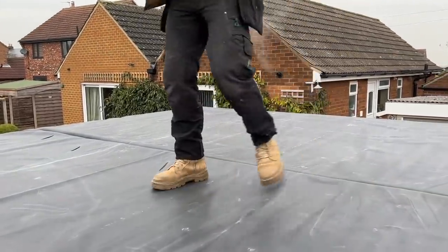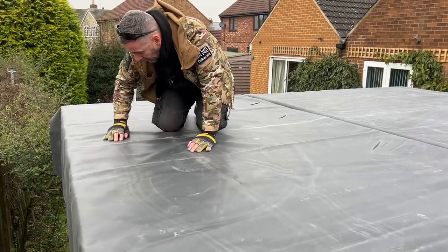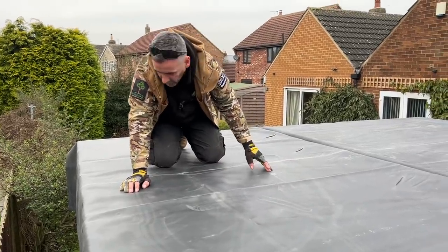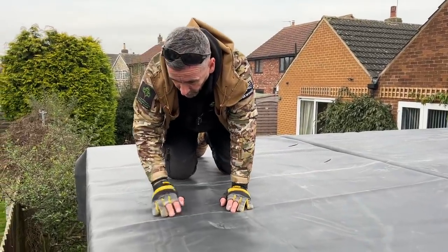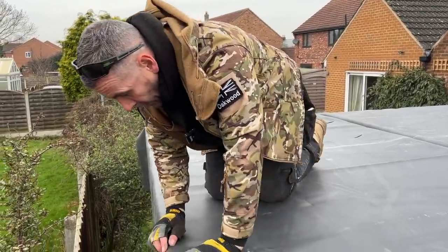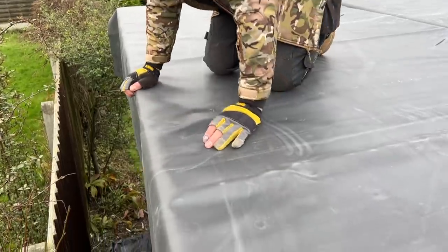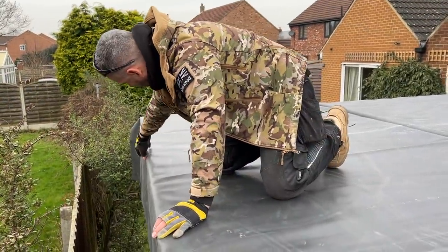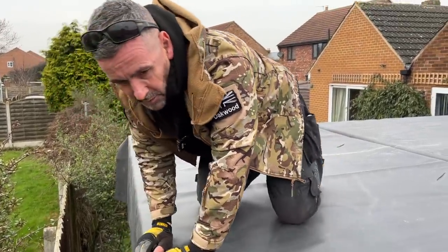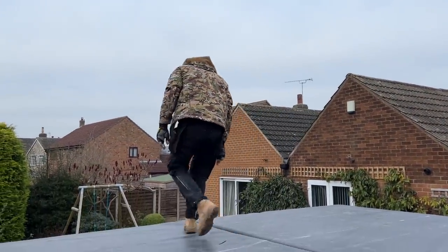This is always a good point — once you've got this rubber down, even if you don't get it fixed, your building for all intents and purposes is watertight. If the weather's bad you can go inside and get other stuff done — you want to look for a clear day to be doing this. Right, so this is the factory seam — when it's made in the factory it's jointed together professionally, it's never going to leak. But you've got that ridge there, and what you preferably don't want is the ridge running left to right, because that's going to hold a little bit of water. It doesn't matter if it holds water but it just doesn't look aesthetically pleasing.